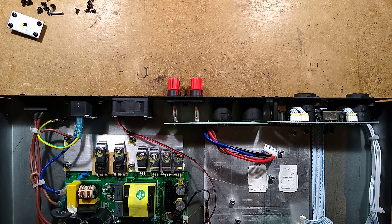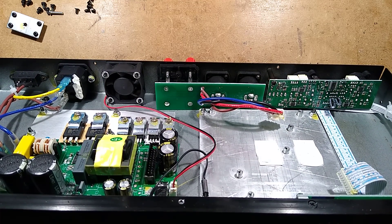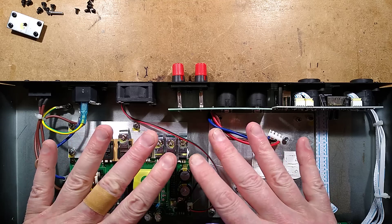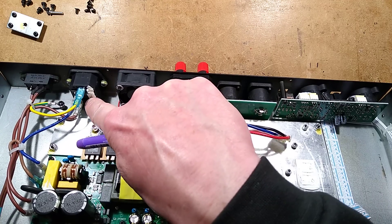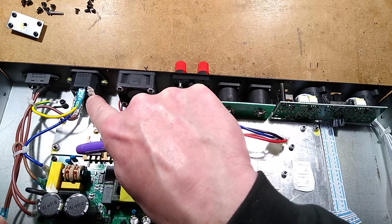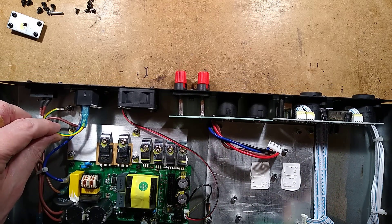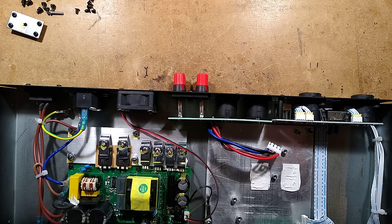That is the Pulse PLA2180D, rated 180 watts RMS per channel. It's pretty good for something so minimalist inside — that's the magic of digital amplifiers. They make life a lot easier in the entertainment industry because they make things lighter. One thing worth mentioning: they've put a nice smear of silicone up the bus bar on the live connection down to the fuse — quite a nice safety feature. And it is earthed, which is also a nice feature, and that earth is snug. The Pulse digital amplifier — very minimalist, very functional.